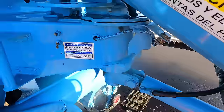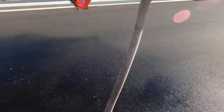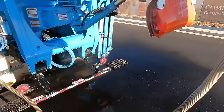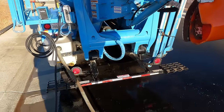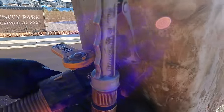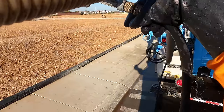For a wash down, we use a reclaim system, which is this bucket. And that box down there, we wash down into this bucket. All the water that's in here goes down through this hose into that box right there. Job sites don't have wash downs, wash outs, whatever. We use this. It's an easy system to use.